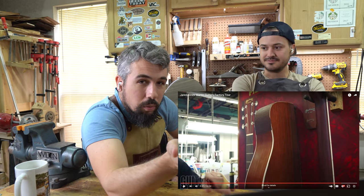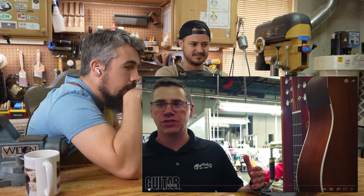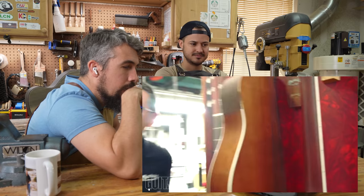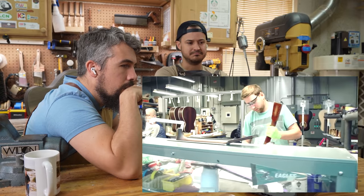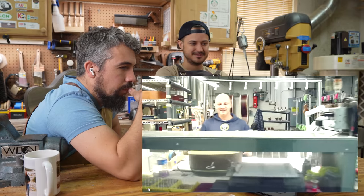I'm still amazed at how many details they're sanding by hand — that's super cool. One thing we do is we have an acclimating room downstairs. We season our wood there and try to bring it all down to about 7% moisture content before we build. These are some inspection areas — because when we're spraying the finish, we want to make sure between coats that it looks good.